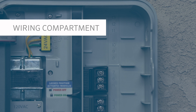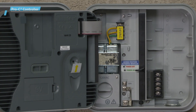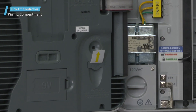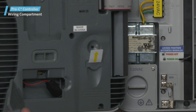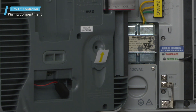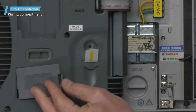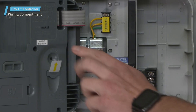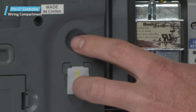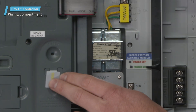Wiring Compartment. The 9-volt battery compartment: installing an alkaline battery here allows programming of the controller face pack without AC power. Use a Coincell CR2032 lithium battery for real-time clock backup. The Reset button resets the controller, keeping all program data intact.